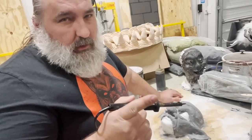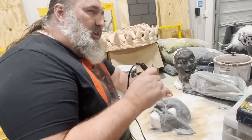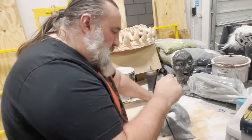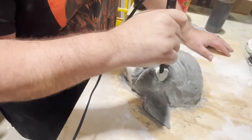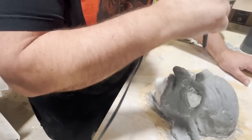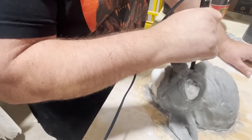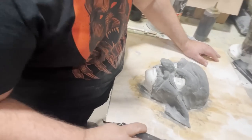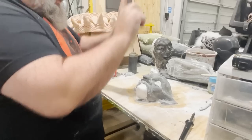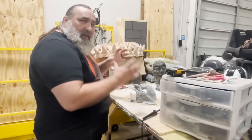I'm going to do something a little weird — I'm going to burn holes in the eyes so that when I make the mold, some resin goes down in there and those are going to be registration points. I go straight in, just a hole like that, straight in, just a hole like that. Inside the mold there'll be two posts that stick up and those will stick into these holes, so I know it's lined up and pushed all the way down. I have to Vaseline inside those holes as well.